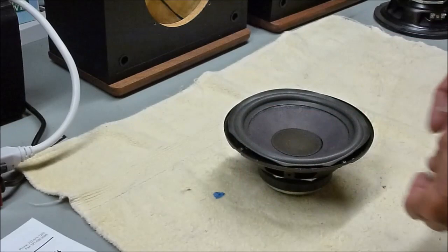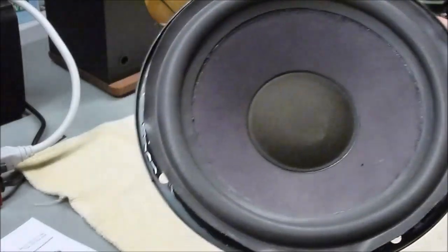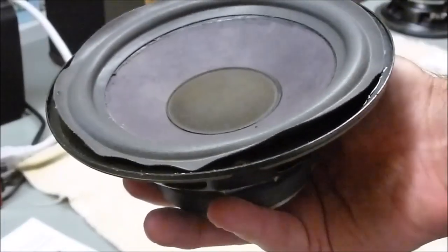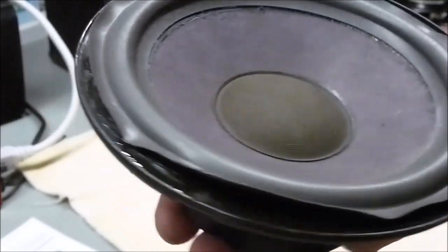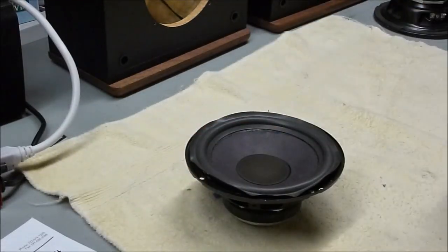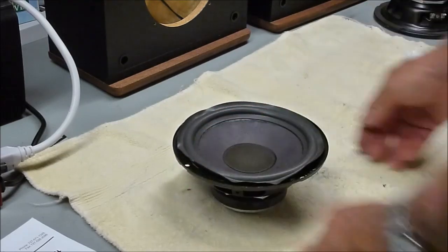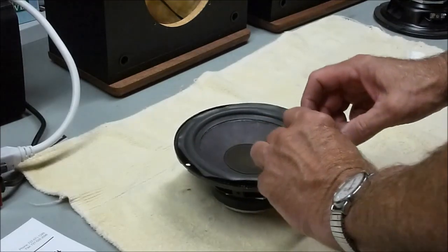But you can see, I don't know if you can see, but the glue makes this foam kind of curl up. I don't know if you can see that on the video. I guess you can. See how it's curling up there? Don't worry about that. If that happens, that's normal. The reactive components in the glue kind of make it do that. Eventually, that will start sticking down. Then you can just let that cure for a minute or two, but keep going back every once in a while and checking to see if it'll stick down a little bit more.